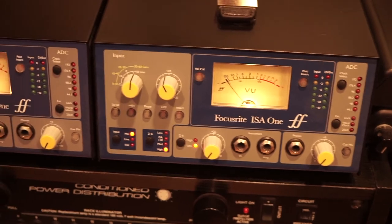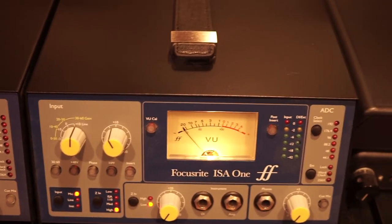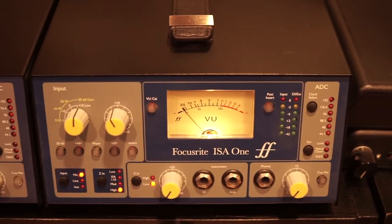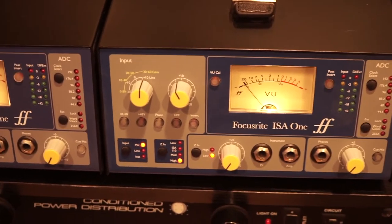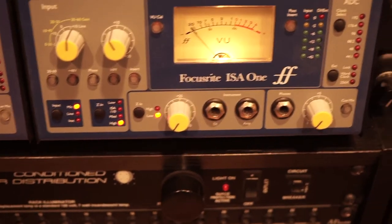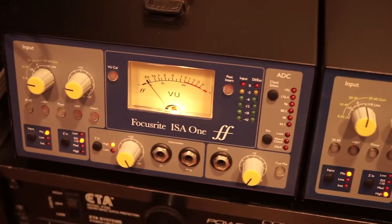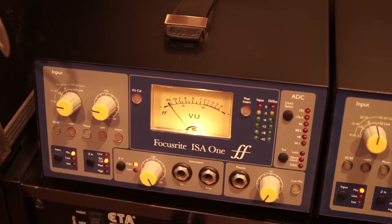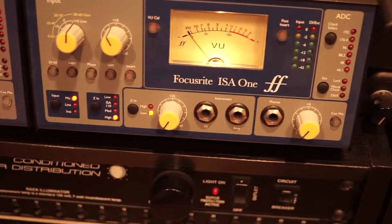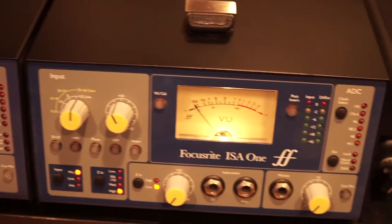And the impedance matching is so important, because if you improperly match the impedance, sometimes you shave off the top end. Sometimes you get a woolly sound depending on the microphone that you're using and the capsule and the components they use in the microphone, especially if it's a cheap mic. You need to be able to dial in the right impedance, and these are very, very flexible. These are a drummer's best friend, honestly. And if you don't properly match your mics to your preamps, you're going to have a sonics problem, especially if you're dealing with clients. And you don't want to piss the client off, because if you piss the client off, it won't be working, boys and girls, honestly.